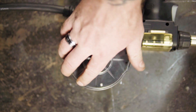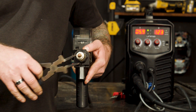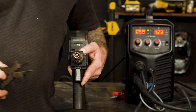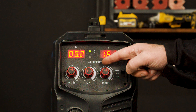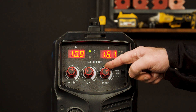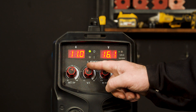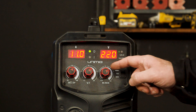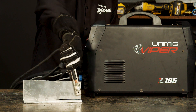Part 4, Feeding the Wire. Pull the trigger on the spool gun until the wire comes out of the swan neck, not forgetting to replace the housing cover and screw tight. Part 5, Attach Final Consumables. Screw on the contact tip, tighten it with MIG pliers, followed by pushing on the gas nozzle and cutting off the excess wire. Step 4, Spool Gun Welding. There are two controllable parameters on this process; we will be setting it up for welding 8mm aluminium. Wire speed control determines how much wire per minute will feed through your gun, while voltage controls the amount of heat and penetration — these two parameters need to work in harmony. Turn your gas on to around 10 to 12 litres per minute, attach the earth clamp to your workpiece, and you are now ready to weld.